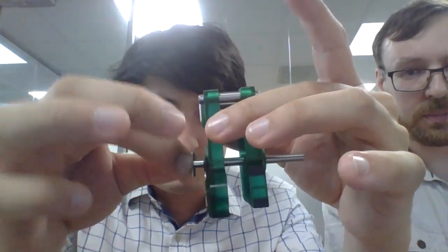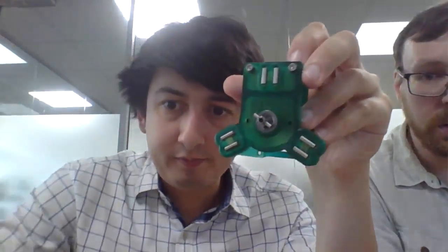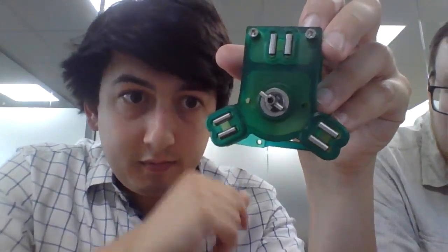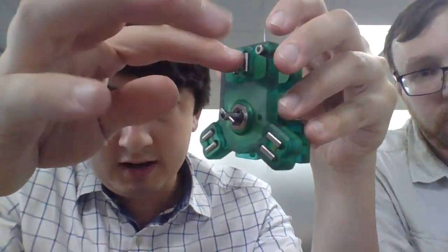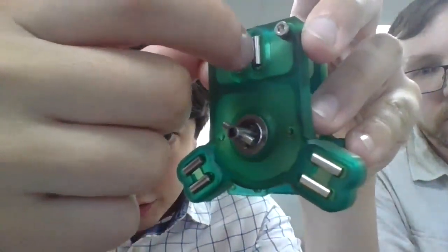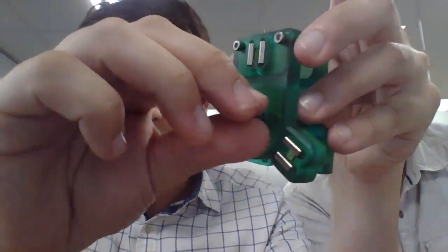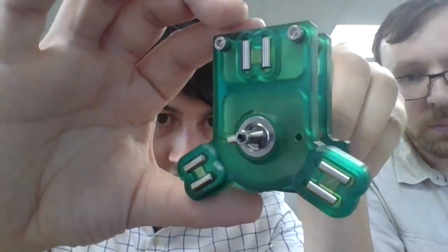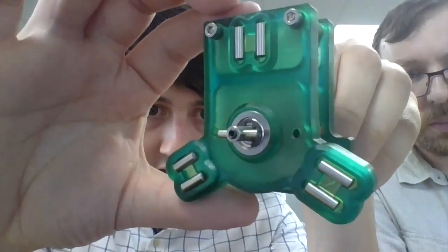This is the grabber. The servo actuates this through 90 degrees. Instead of the nasty aluminium grooves, we've now got hardened steel dowel pins as the kinematic locating elements up here and down here. There's actually a little recess in there into which your ball can sit. I'll just let everyone recover if they're having audio issues. What occurs is that the servo is able to actuate this through 90 degrees, and that is what locks the whole affair into the tool.